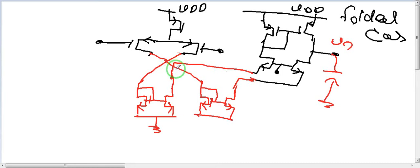Now we have recycling, but there is a problem with this circuit. If you increase the gain by sizing — for example a ratio of 1:3 with a current of 10 microamps — you get problems. There is a paper that came after the original showing you cannot go beyond a ratio of three: beyond that you lose power efficiency and your figure of merit (FOM) will be ruined. You end up doing work that isn't worth it.